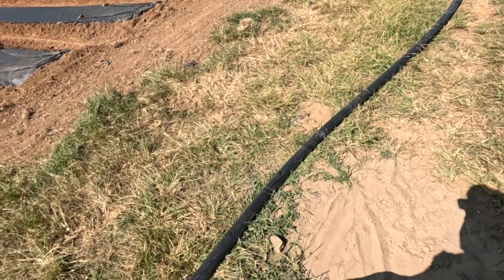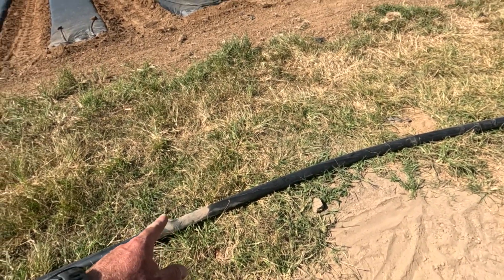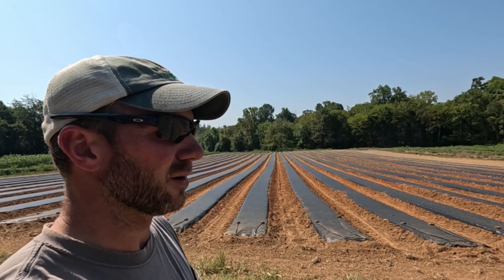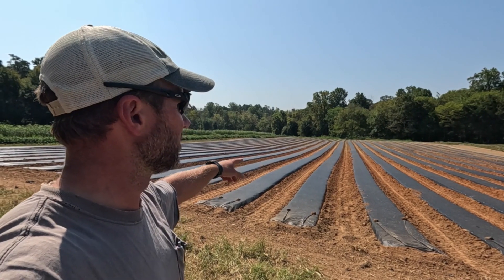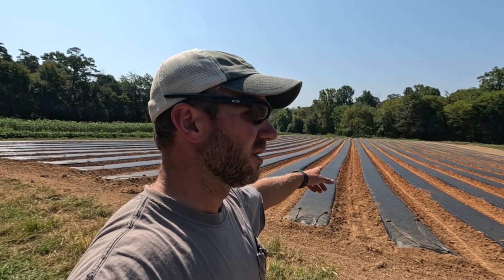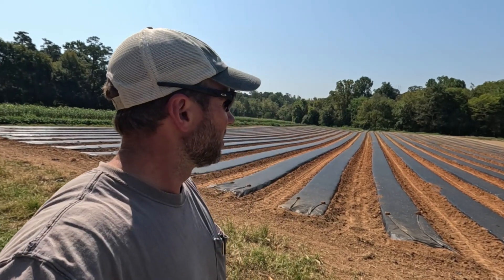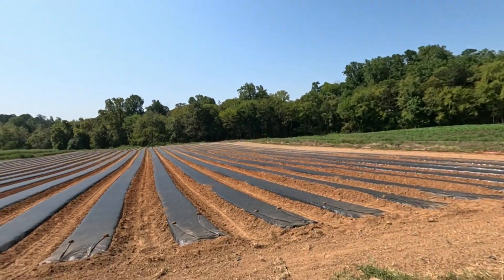For this strawberry field I've been using poly black oval hose for the past couple of years and I've kind of gotten to where I like it. Two-inch is going to be pushing the limits of how much water you can push through for this amount of acreage. This is a little over an acre, which means it'll be about two and a quarter acres worth of drip tape because we've got double the drip tape. But with the big pump and a four-inch supply line, we should be good to go.